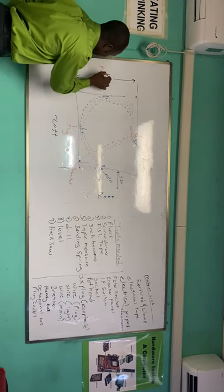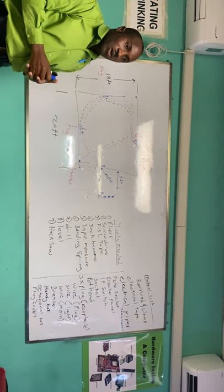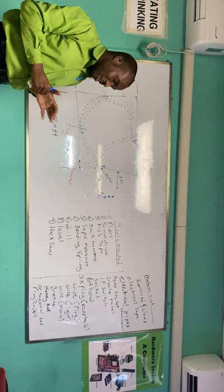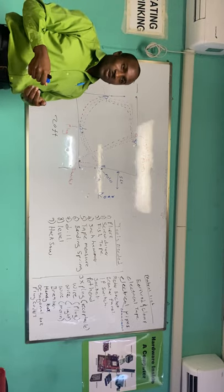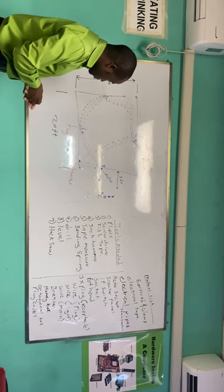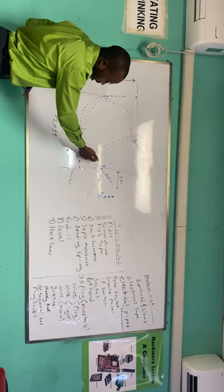The room is 20 feet by 18 feet. Each electrical pipe comes in 10-foot lengths — all electrical conduits are 10-foot length. Water pipe is different, coming in around 19-point-something feet, but for electrical conduit they are 10 feet. This room is 20 feet, so basically to do the plug circuit I am going to need two lengths from one end to the other.